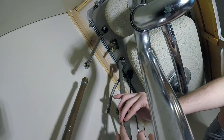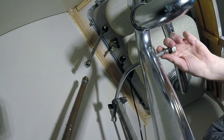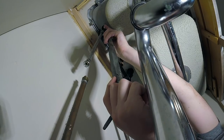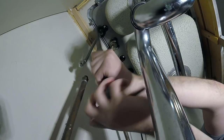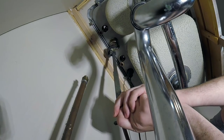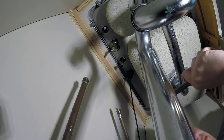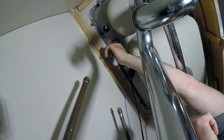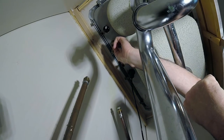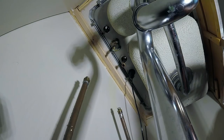What's up there? Little brass nuts? Yeah, they're hand-tight. I was going to give you the half-inch wrench — if I remember correctly. From where I cut the hose, what do I loosen to take that off? You gotta take this brass piece right off the bottom. And then you see that brass nut — more brownish — you take that fitting off. That's actually a combination thread and it's supplied for the faucet. Take the brass off and then take that nut off, and that whole brass coupling will drop down for you.